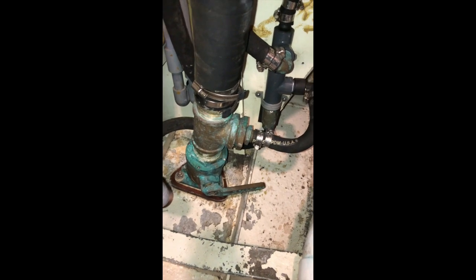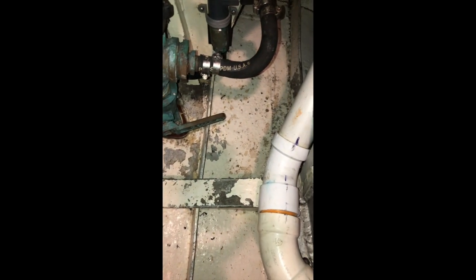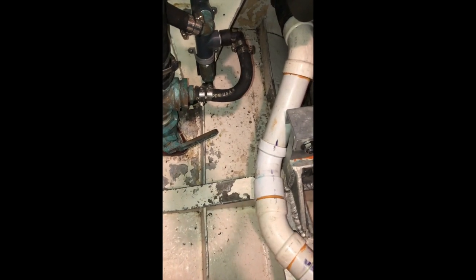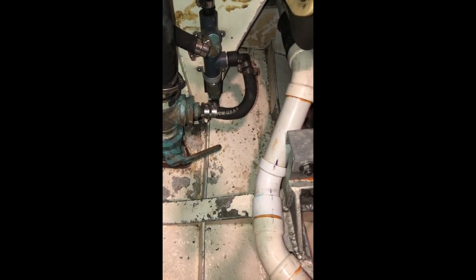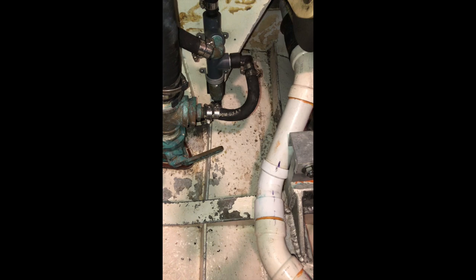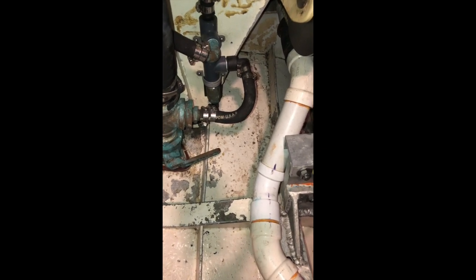That's the nice thing about aluminum — if you can get access to the bilge, corrosion either is there or isn't; you can see it. The paint on the hull is all flaking, and people get worked up and say it should all be coated to protect the aluminum — this is false. There is absolutely no reason for coating aluminum. The builder of this boat didn't make many mistakes, but he did make one doozy: he painted the bilges. I've spent the last 30 years, every time I clean the bilges annually, scraping off loose paint. So tip for you — if you're buying an aluminum boat, do not paint the bilges. You will never get the paint to stick and you will hate yourself. It doesn't do any harm.